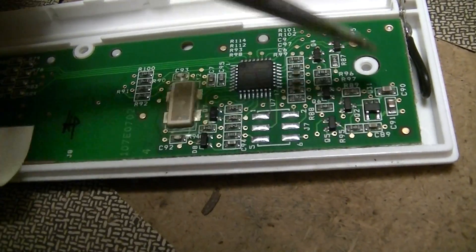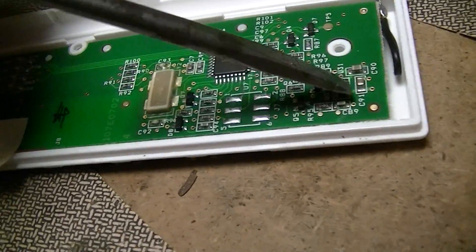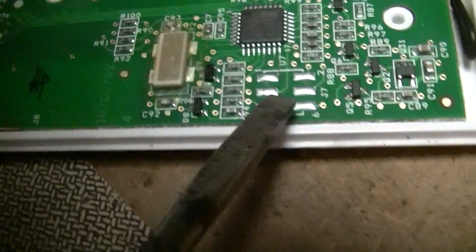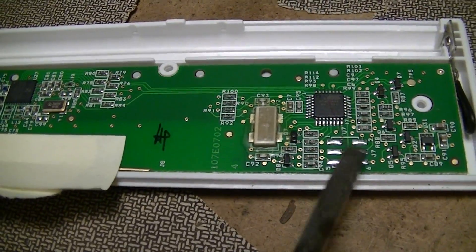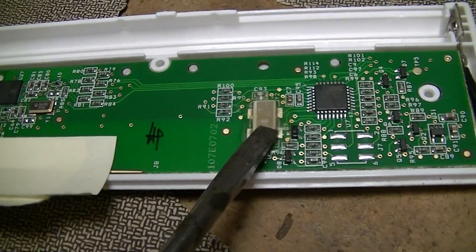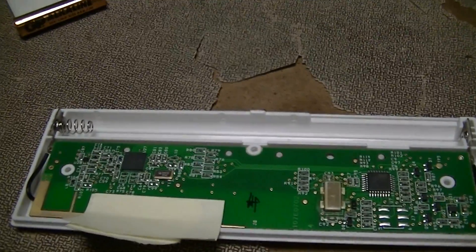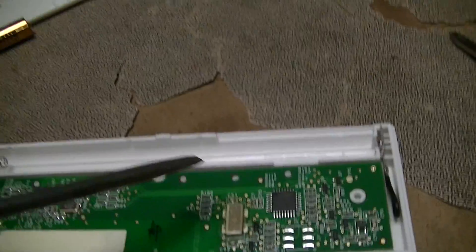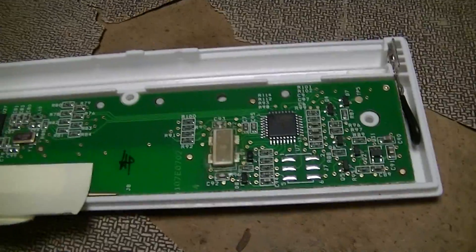I think some of them are diodes, some are transistors. That component there I'm guessing is probably an operational amplifier or something. There's an unpopulated header — J7 — that's probably a programming header for the micro. There's a crystal for it, covered over in a waxy stuff, which I guess is just for impedance control to prevent things like condensation from throwing out the operating frequency. A couple of local fiducials for the machine vision system in the pick and place machine — fairly normal stuff. There's a test point for a bed-of-nails tester or something.